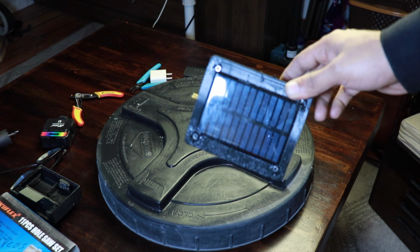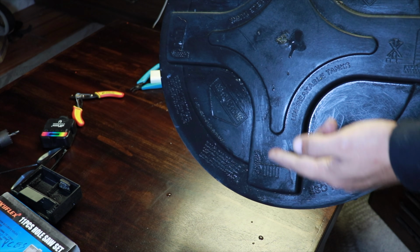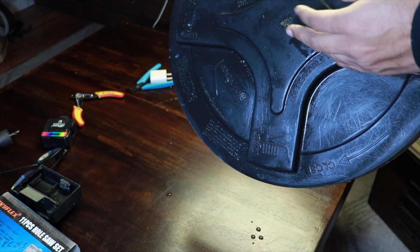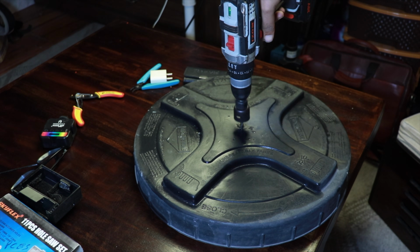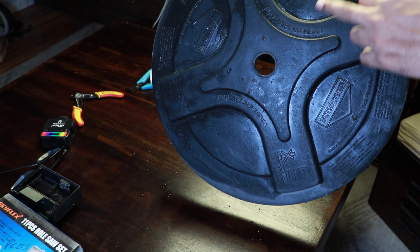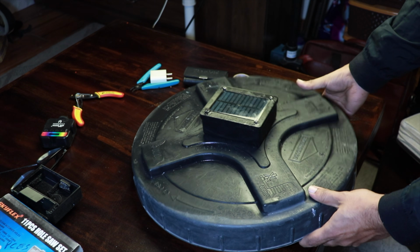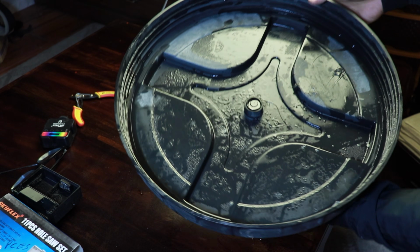Now let's talk about the real world installation. The transmitter is installed on the top of my 5-story building. I've installed it on the cap of my water tank by drilling a 32 mm hole, and we have used a 3D printed screw to hold it tight at the top of the tank. With the cap, if you want to clean your tank or do whatever, you can just easily open it.